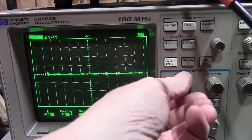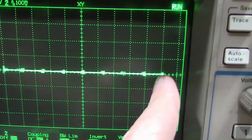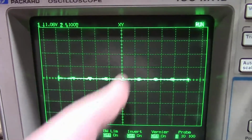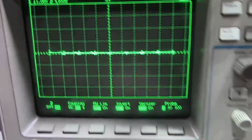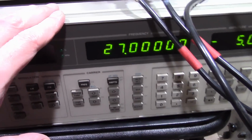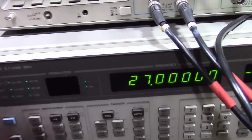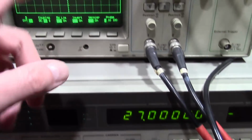And if I want to make my life a little bit easier, if I get everything set up right so that these markers coincide with the grid on the screen, I know it's all 1 megahertz increments, like 20 megahertz, 21, 22, 23, 24, 25, and so on. And if I do that well enough, I can kind of get away without using a marker generator at all. But some of the frequencies they want me to dial in are a little bit oddball, like 22.1 megahertz, so it can be nice to have this. Also helps to double check the accuracy of these markers with an external generator.